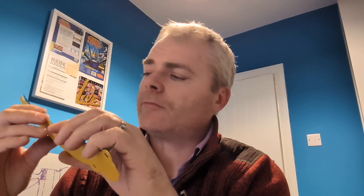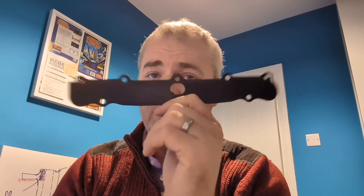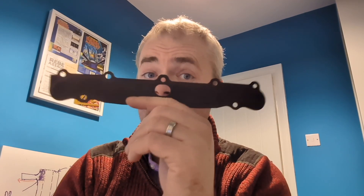So what would be my next steps? Well if I was at work and I did this, not only would I be quite embarrassed, I would need a quick fix. My quick fix would be to put this on hatched drawing paper - one mil drawing paper - and draw around this with a sharp pencil. That would allow me to gain a lot more scale and measurements. But I'm trying to show how you could put more complicated pieces into CAD, so I'm going to try and not rely on that luxury and still work from the photograph if I can. You might not be doing something flat - you might be doing something more complicated, and I want to help you guys with that.